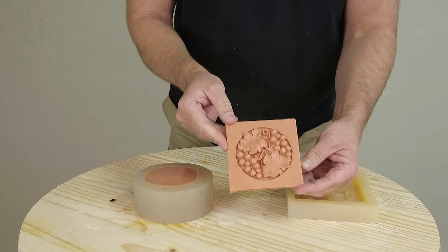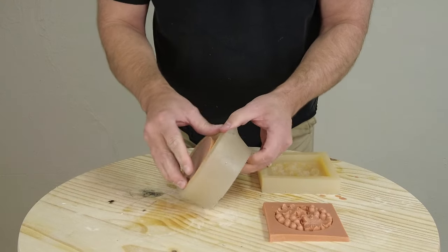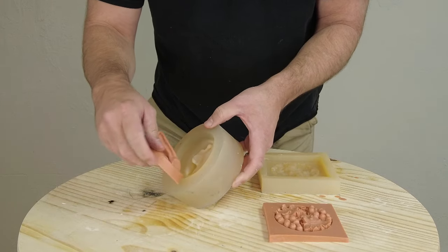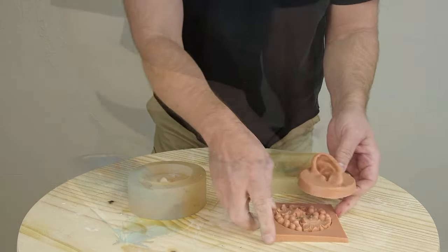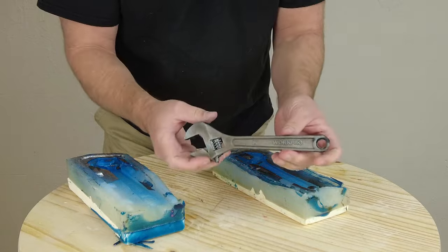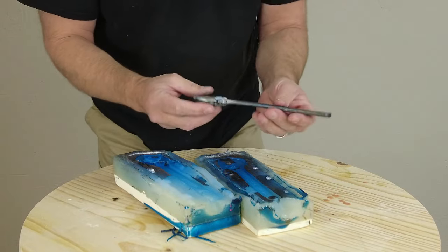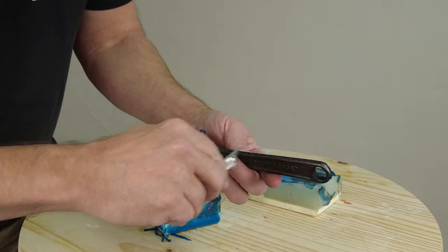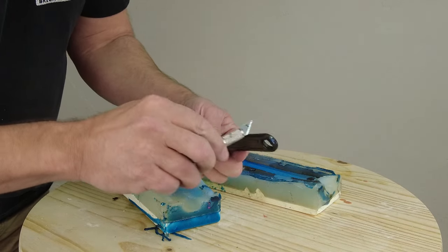The other little test parts have come out beautifully — still a little green at this stage, but you can see how the flesh pigment works well for medical simulator applications. A lot of customers use the softer FP25 for gunshot simulators backed with 266 flexible foam. Back to the wrench — still a little green, but after a few hours it'll be firmer. At this stage you can use an exacto knife or scalpel to clean up the flange, and now we have our finished prop wrench.